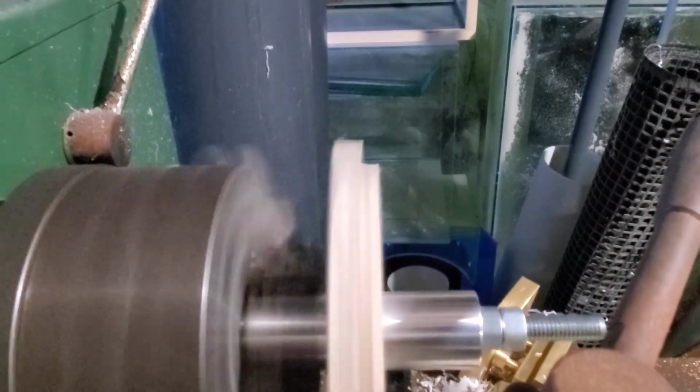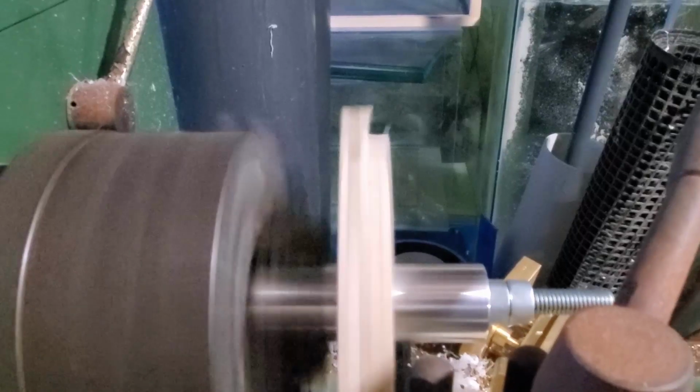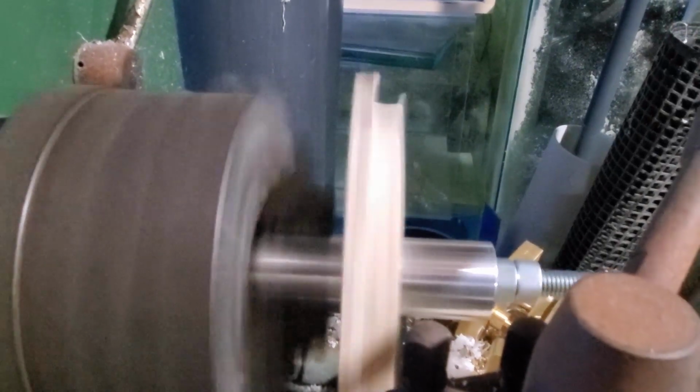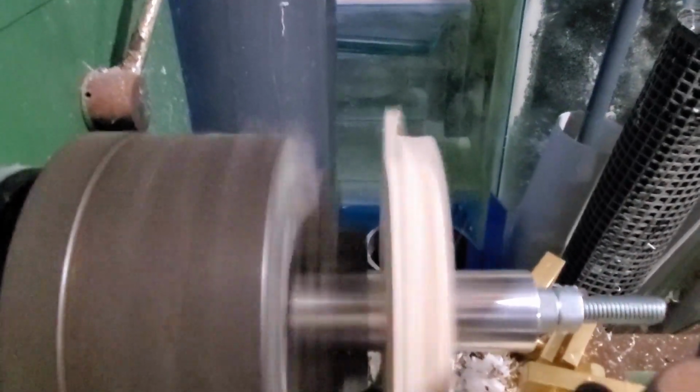The downside is if you try to take acrylic tubing in this case and clamp it into a lathe, it's very flexible. Flexible and brittle. And what happens is you try to clamp it down, it just deforms, and you can't get a good grip on it. And because we're going so big, this is actually a really big issue. I can't get enough of a grip on this to actually do any work on it. So I am making an insert.